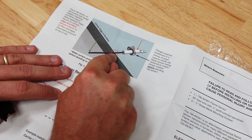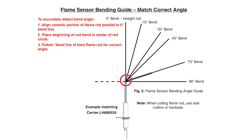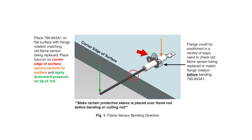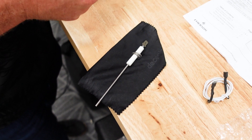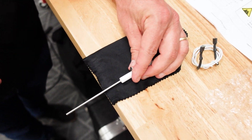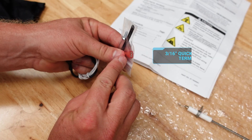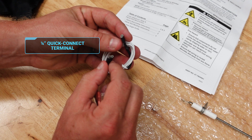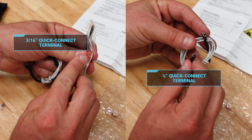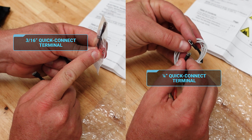On the other side, you can see how to brace the rod against the edge of a surface. Below that, the instructions show you the degree of bending. You're not going to bend it beyond 90 degrees, but the flange position matters when you go to bend the rod, so you'll want to compare it to the old rod before you begin bending it, and then again make sure that it's the same after you bend it. You can bend it by hand as shown, but many of you will find it easier to use pliers or channel locks — just make sure you grab onto the bending sleeve and not the rod itself. It's nice that this comes with a screw and a bending sleeve, but it also has a 3/16-inch terminal in addition to the standard quarter-inch terminals. So the sensor works for a quarter-inch terminal but can also work if you have a smaller termination on the board — you just cut the old terminal off, strip the wire back, and use a proper crimping tool to replace the terminal.